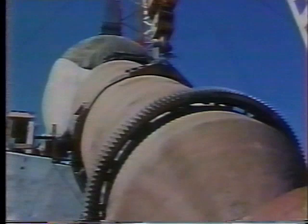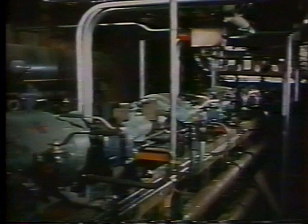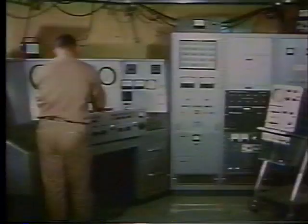Mechanical components had meanwhile been under construction on and inside the pedestal. Each of four main supporting hydropads and each of four cylindrical positioning hydropads in the tail bearing would receive about 11 gallons per minute of hydraulic fluid. The telescope thus floats and is held in position by a five-thousandths-inch film of oil. The flow to each hydropad recess is maintained by 32 constant-volume, constant-speed pumps delivering oil at pressures up to 4,500 pounds per square inch. These pumps are located on the second floor of the foundation.